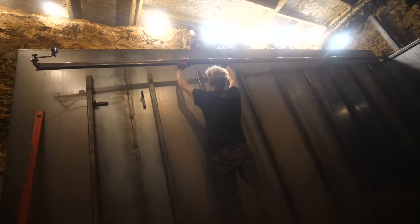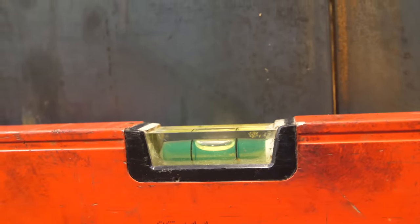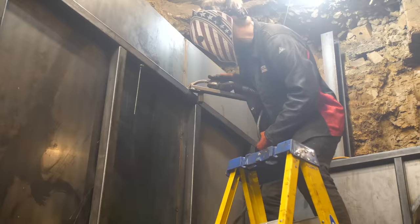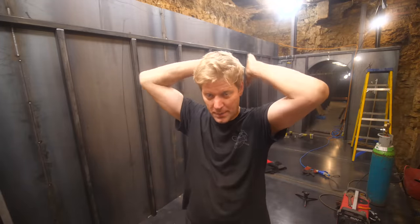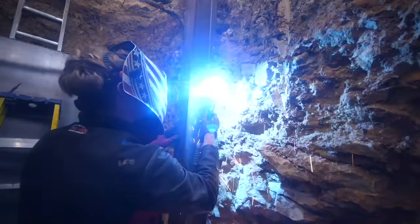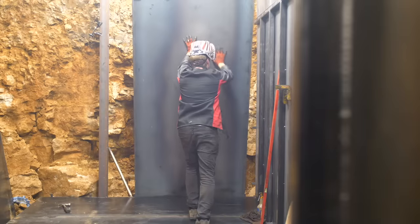Once the wall sheets and uprights are tacked in place, you add a horizontal length of box section across the top, checking for level and straightness. There's a little bit of warping in the sheet, but with a simple tool you can pull it back to shape, weld it together and your wall is straight. Without a tunnel to brace off this side, I found myself knocking pegs and pins into the clay and stitch welding it to the frame at the bottom - this will add reinforcement to the concrete when it goes in.